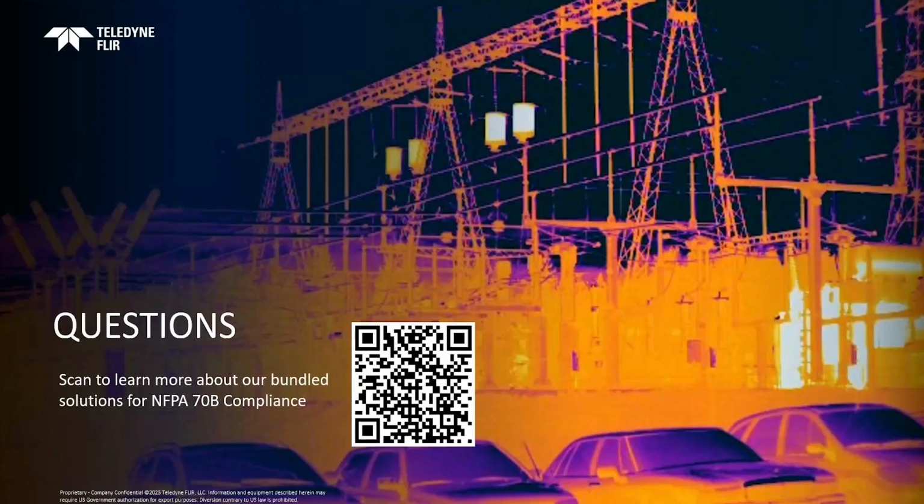Well, as you stated during the webinar, John, load is important. There are a lot of questions about, can we de-energize equipment, open it up, and then re-energize equipment to heat it up? And that's something that some people practice. It can be difficult because depending on the size of the equipment, depending on how much load is upon it, once we remove load, reheating it could take just minutes, or it could take longer. It could take 30 to 60 minutes to get it to a point where we can analyze it.